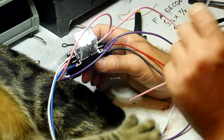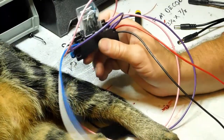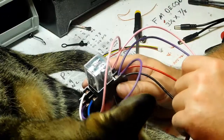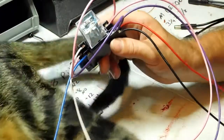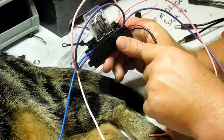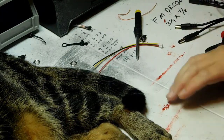To recap: battery power comes into the relay and out the blue and white wires when the relay is off. When you plug in the power supply, power is supplied through the pink and purple wires to terminals five and eight, jumping over to terminals 13 and 14 to activate the relay. When the relay turns on, it disconnects the battery and only allows power from the power supply to come through to your project.